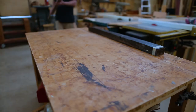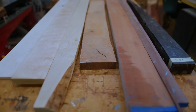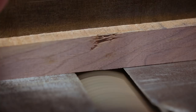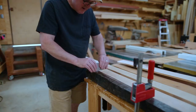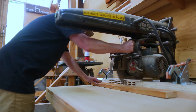The first thing I started with was the grid of little squares, and in making that I found a bunch of different species of wood to cut into strips. Everything from really light maple through some birch and cherry and a little kaya, I think, but I'm not sure. Some walnut and then finally a piece of ebony for some black bits. I jointed and straightened out all my pieces of wood and once I did that I could start cutting them into strips.